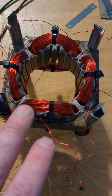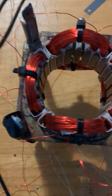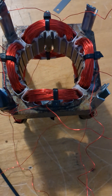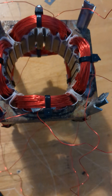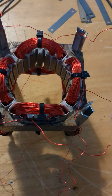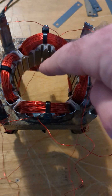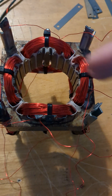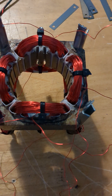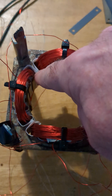That is the issue right now, and I'm 99% sure I know how to correct it. I don't plan on taking this apart again because this was a hairy build — I've got 400 turns on each phase, a total of 800 turns in there and it was hard to get into the slots. You could use a one-phase or two-phase pickup coil 90 degrees out of phase and get equal balanced rotation, but you can't do three-phase, four-phase, or any polyphase configuration because of this gap.